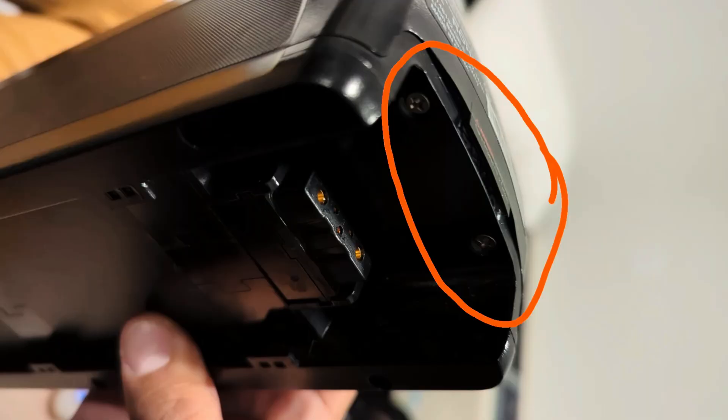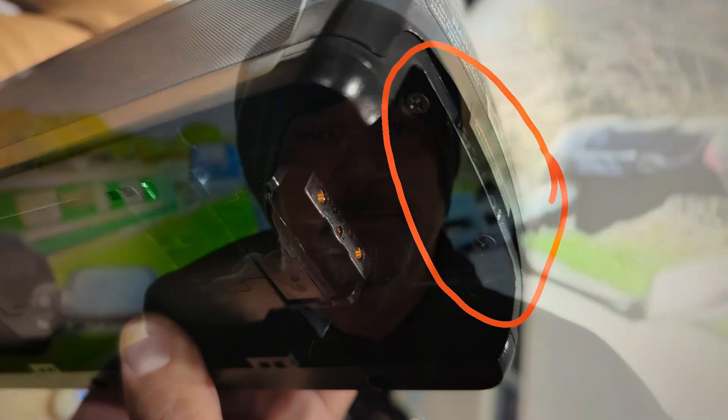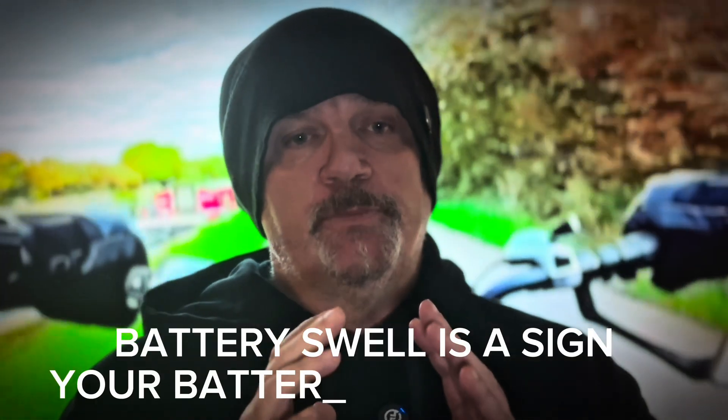In the summer months is where you're more likely to see an e-bike battery fire because of overheating in the cell pack. If you charge your battery in your bike, take it out once a month and examine it. If you see any swelling in the battery pack, it's dangerous — take it to someone who knows what they're doing with batteries, or take it to your local recycling center. A swollen battery is a sign that a chemical reaction is going on inside.